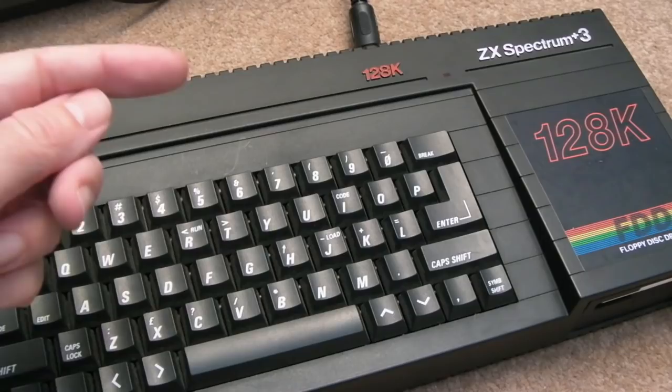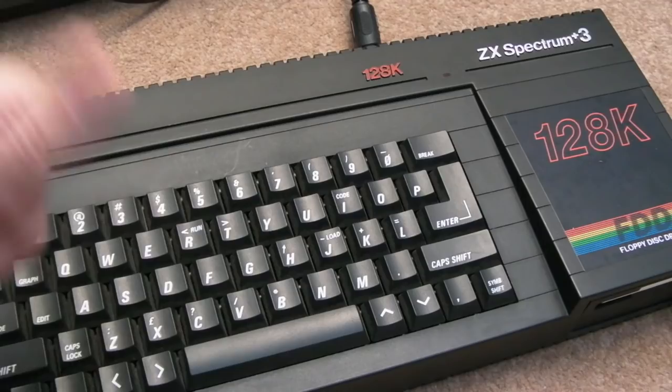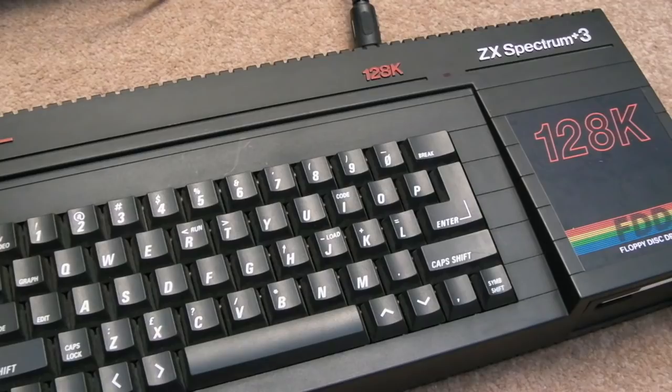It's just slight, it's lower level, like 50% less, like line level, so you need to connect an amplifier up to use audio from the back there, but it's only mono anyway, it's only on one channel. You need a specific cable. But it's crystal clear. If I listen to the headphones now, it doesn't sound distorted like it was before, and it doesn't sound like there was a missing channel. There wouldn't have been a missing channel. What was probably happening is the filtering was so over the top and distorting, it was cutting out certain sounds and stuff. So anyway, it's perfect now.